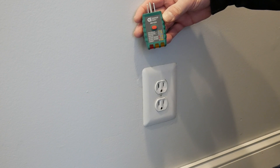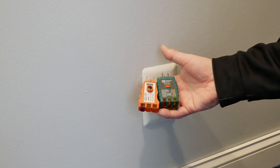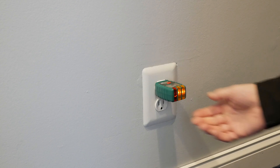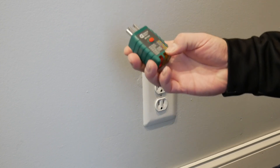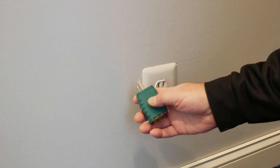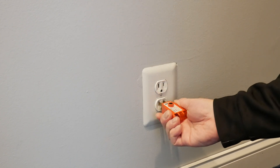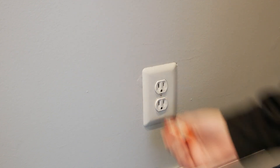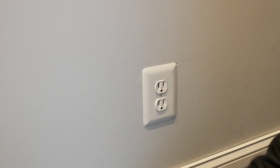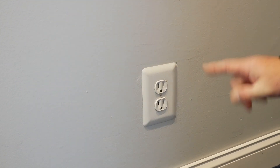Now we're going to test it with this electrical tester. I have two electrical testers from different brands. This one is Sperry Instruments and this one is Commercial Electric, so we'll plug both of them in. The Commercial Electric shows correct wiring - model number MS-102H and it is ETL certified. The Sperry Instruments also shows the same pattern that is correct, and this is UL listed. Get an electrical tester but make sure it's UL listed or ETL listed. You can verify your outlets are wired correctly, which is really important, especially with GFCI.